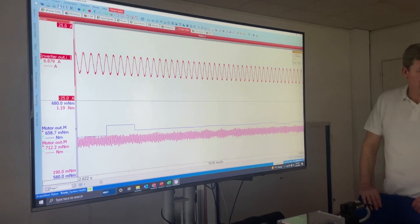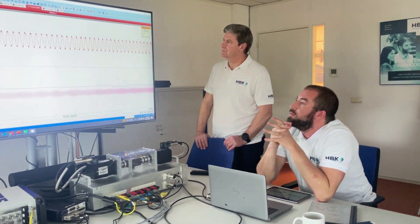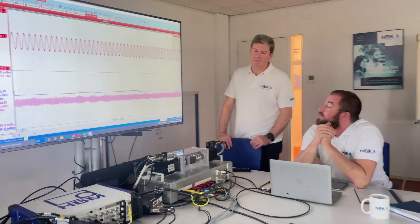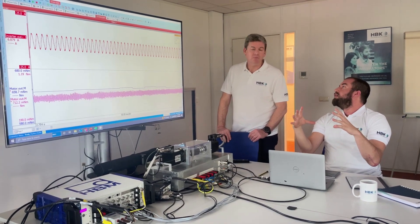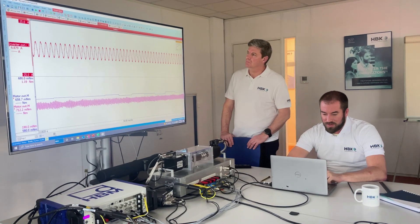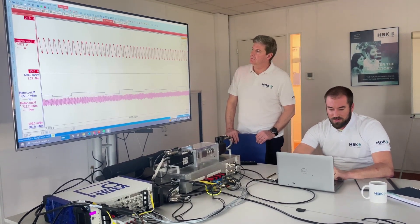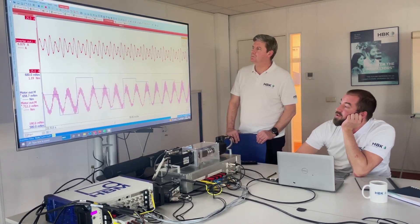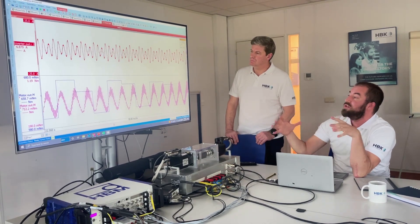Again it depends on the application. Automotive machines have a pretty high inductance and that's a good filter. But in aerospace machines, to save weight, you cut back that back iron. And now you have a situation that's a lot more — like this. Where those currents are gnarly and that torque is swinging. And that makes the machine vibrate — that will couple the structures.